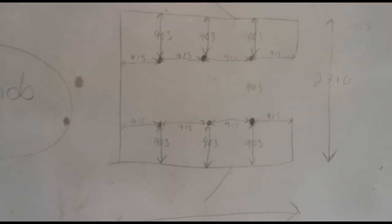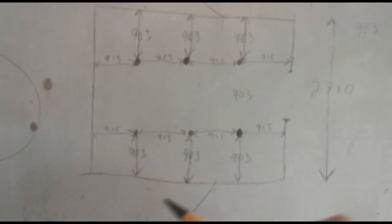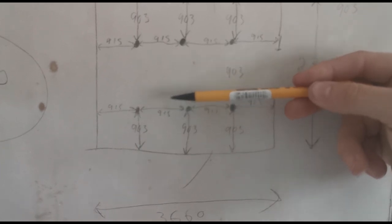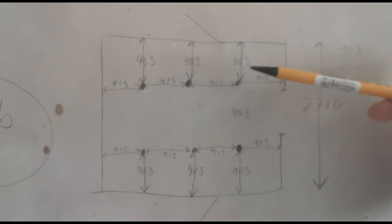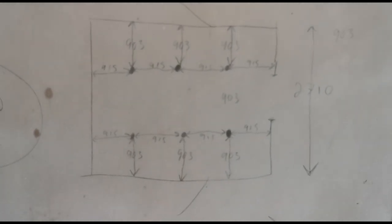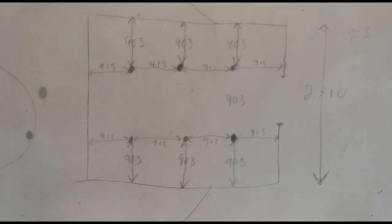I'm going to laser this side as well — so we've got three of the six. Here's the little schematic: we've got this window over here and all the measurements between. We've basically taken this number, divided by three, and just seen if it works. Sometimes you do that and these end up looking really close together, so you might end up going 800 or 900 off — but you don't want to go more than a meter apart or you start getting dark spots with downlights. That's all marked out in the ceiling and we'll take a picture to drill the holes from later.